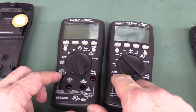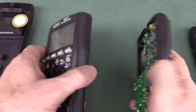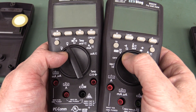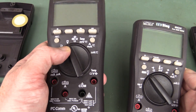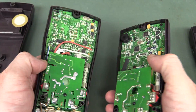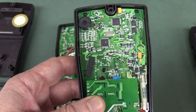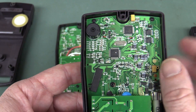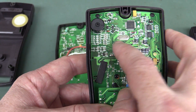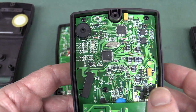They've changed the organization of the amps jack and the milliamp/microamp - they've swapped those around. They've put the chipset on the top and the chipset has changed. You can tell when a multimeter chipset changes by the fact that now they've got volts AC and DC on the same range, whereas this one had volts DC and AC separately. I do not know which multimeter chipset they're using here - it's Brymen branded, so they won't tell me, it's proprietary. Anyway, we've got an LCD driver up here.